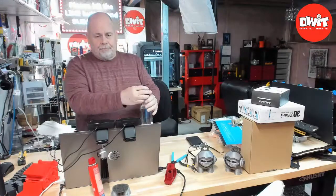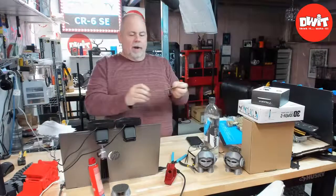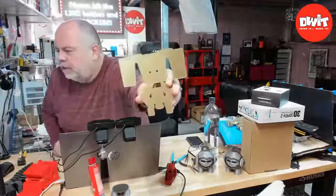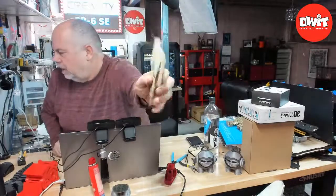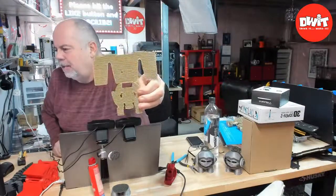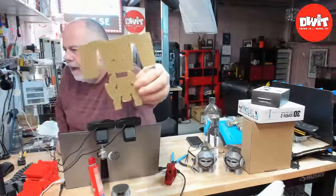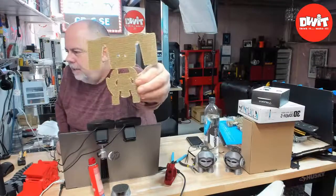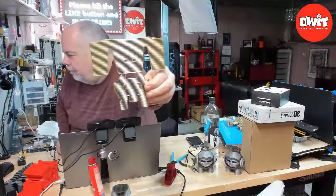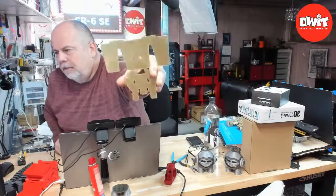Now a raft, unlike a brim, if you look at the way this did the raft, the first layer of the raft is a typical decent first layer. And then on the top layers of a raft, they purposely are thick lines and separate. I'm sorry, this is the first layer of the raft, so that's the layer that's on the bed, and those are thick lines with obvious gaps in between them. And then as the raft builds up, it gives it a nice layer.